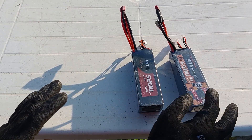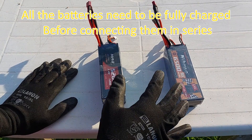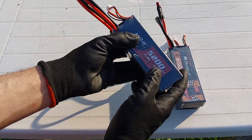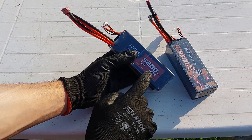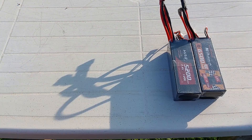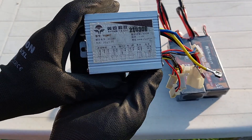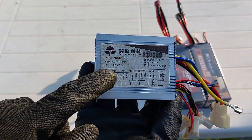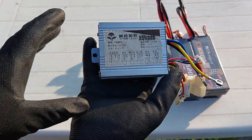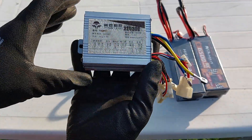So in conclusion, connecting dissimilar batteries together did work. Of course, I'm not recommending this — this was just a test. I would pair similar milliamp-hour batteries if I had them. The 5200s discharged faster and they warmed up a little more, though they do have a higher discharge rate at 120C, so that's a good thing. The controller worked fine and handled the few extra volts. Because it has 50-volt capacitors doesn't mean it's going to work with 36 or 48 volts — a fully charged 48-volt battery is going to be over 50 volts. It's not going to work; it'll fry the controller.